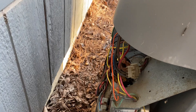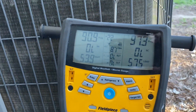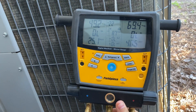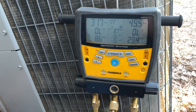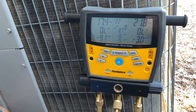Look at your pressures — you're going to see them go down. Your compressor's on. Once it starts getting really low, you can start closing your valve. Get it down to about 10 PSI — that's what I usually get it down to — then start closing.